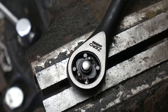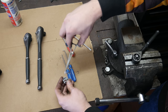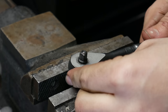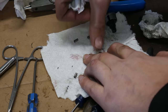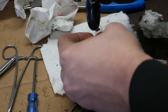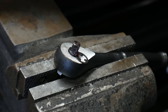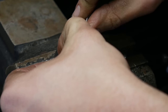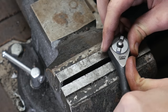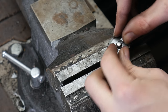Even though the detents in this one actually worked okay, I figured might as well make them a little bit stiffer. So we repeated the same thing with the pieces of coat hanger, although this time the pieces had to be very, very short. Then I decided it would be for the best to take the ratchets fully apart and clean them, then pack them with new grease. So we removed the clip retaining the drive head on the ratchet, cleaned up all the parts, and reassembled the drive head and switch assembly, then packed everything with some synthetic wheel-bearing grease. Unfortunately, when reinstalling that tiny clip for the drive head, it shattered. I didn't have the right size external C-clip that would fit it quite right, but I dug a clip out of the parts drawer and sanded it down a little bit to make it fit. It looks a little funny, and I would feel better about replacing it with a better snap ring in the future, but it should do fine for now. We'll wipe up all the excess grease and make sure the ratchet still works properly. The detent is nice and stiff, even clickier than before, and the ratchet seems to work perfectly.